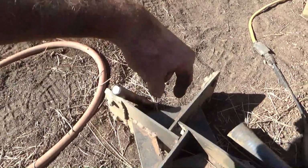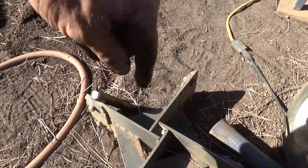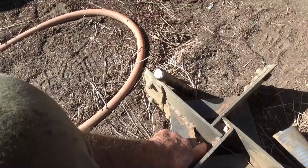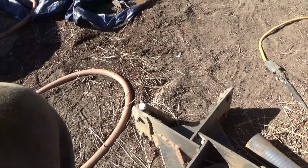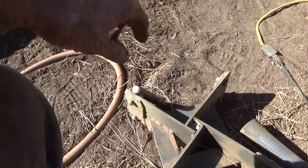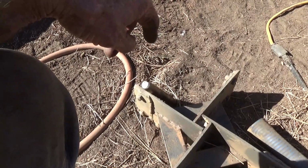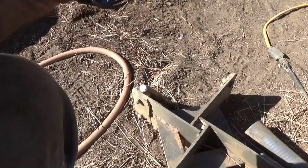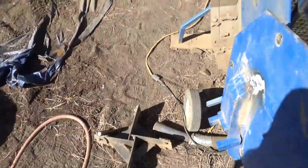I'm thinking maybe take it to a machine shop and just have them drill that out, stick a shaft in there to about there, and then just plug weld the end as the connection. That way the shaft itself has no negative metallurgy. It's all very homogeneous, especially at this end where all the strain is. Anyhow,